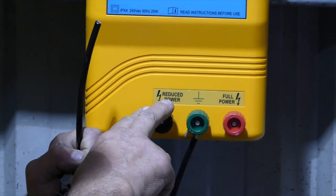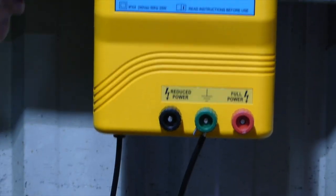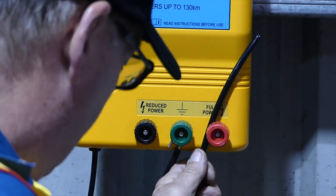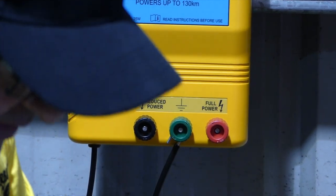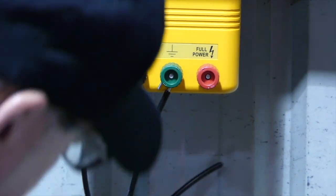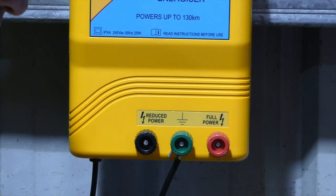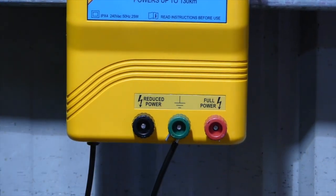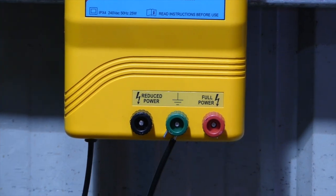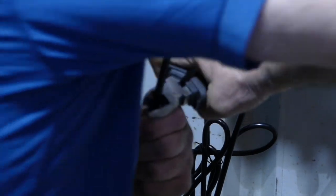a great safety advantage feature. So what we're going to do here now is simply measure where we want to do our connection. Cut enough to allow a loop in the wire. Then we need to cut the insulation away, just gently. We don't want to damage the internal core, the galvanizing on the internal core. So just be a bit patient and work through it bit by bit.